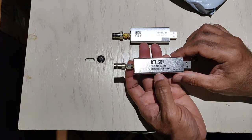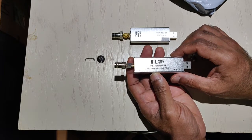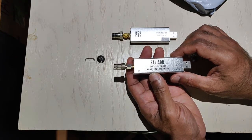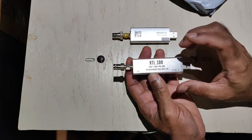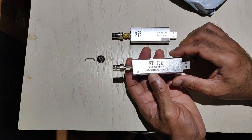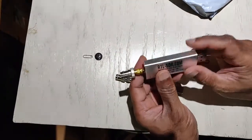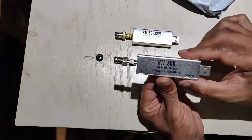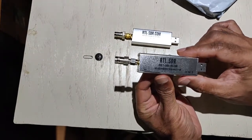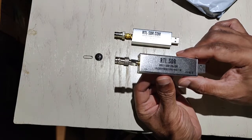Setting aside the bias-T, the TCXO and HF as written here — it does not work, simple as that. The screen may not show when I adjust the PPM, but it is currently at plus 66. There's a known aircraft frequency from the Toronto airport — a known frequency. As you can see, to receive it I had to set plus 66 PPM on the clone, whereas on the original I can tune to that frequency directly and receive a full-scale signal without any issues.